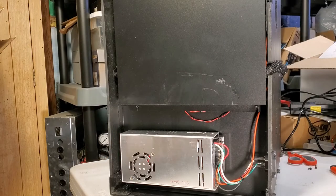Today I was fixing up my wife's MakerBot 2x 3D printer. You can get these relatively cheap, but being American-made — at least designed — a lot of the spare parts are expensive. One of the things that often fails is the power supply. It uses a 24-volt power supply with a 4-pin DIN connector on the end, so they're a little hard to source from third parties.